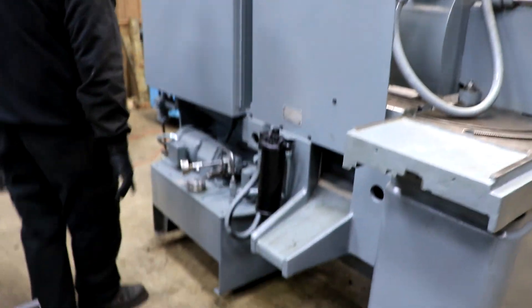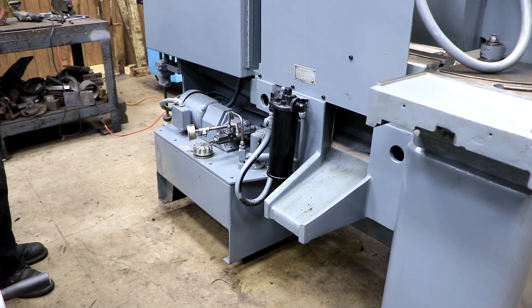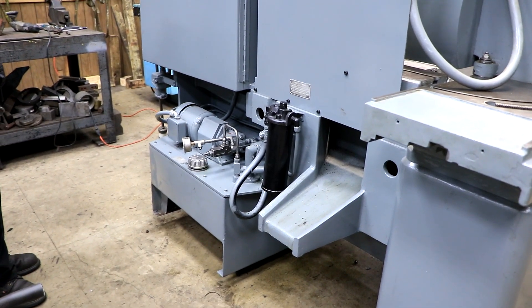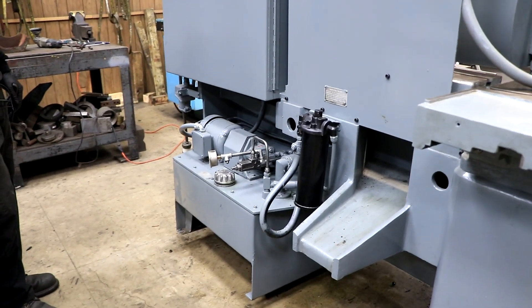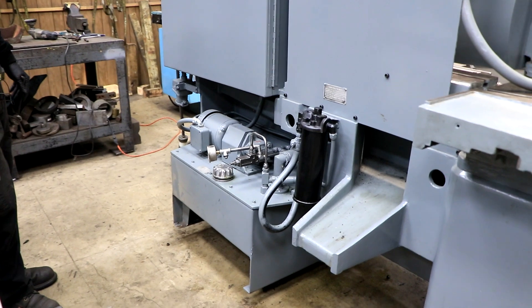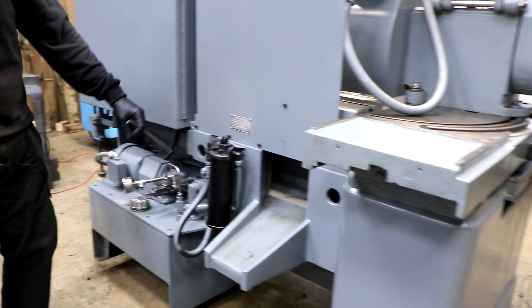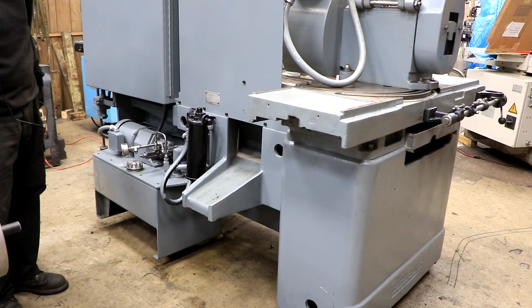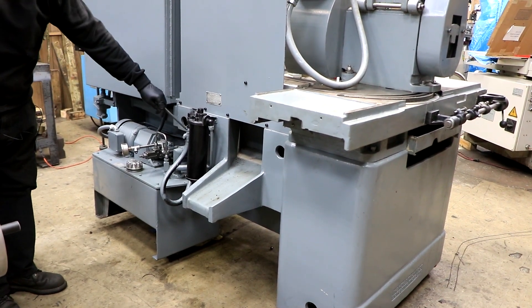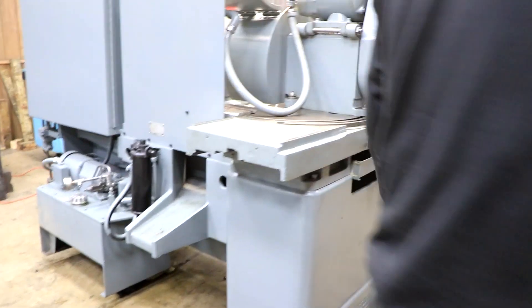Back over here you have your hydraulic system. This uses a special kind of oil — Mobil DTE Light. We have disassembled this entire tank, scraped all the crud out of it, wire-wheeled the inside of it, and filled it with brand new fresh Mobil DTE Light oil and new gaskets. The filter here has been changed with the proper filter from what used to be the service network that sold parts for Heald. This whole table slide has been taken off, re-lubricated, and cleaned up.